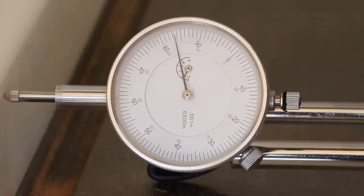The needle moved by sixteen thousandths of an inch, so a 90-degree turn on our screw advance will advance our fence by sixteen thousandths of an inch.